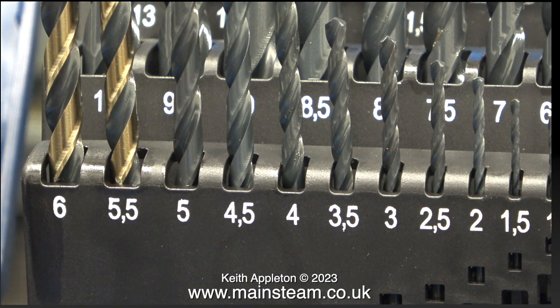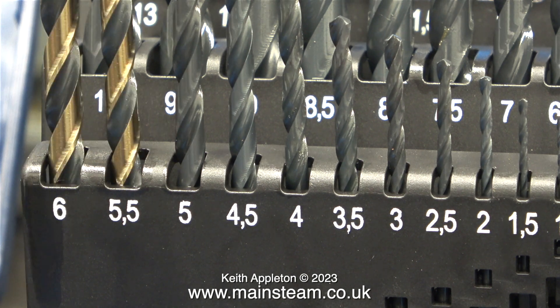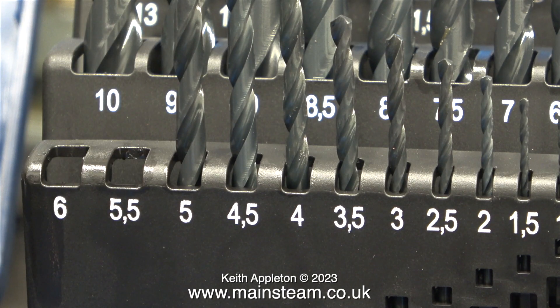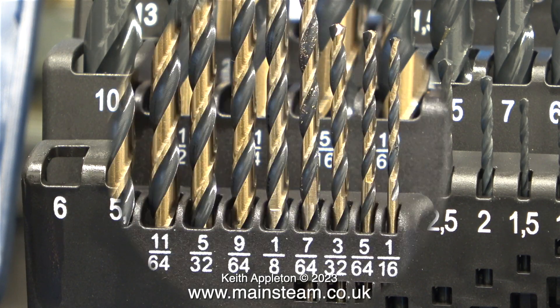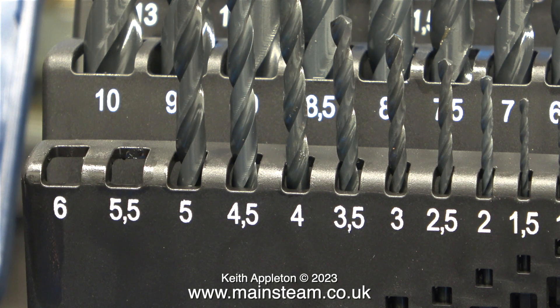The chart I have pinned to my workshop wall, downloaded off the internet, has clearance sizes as well as tapping sizes, which is very useful. When I substitute some imperial drill bits for metric ones the sizes are very close, but when it comes to drilling tapping size or clearance size holes they need to be correct. For instance, one eighth of an inch imperial is exactly the same size as 3.1 millimeters. It's permissible to use a 3mm drill bit as tapping size for 4 BA, but 3.1 is one eighth and that's what I would go for.